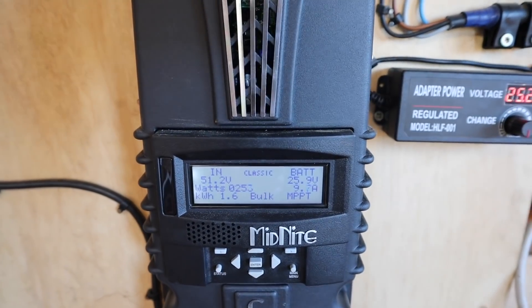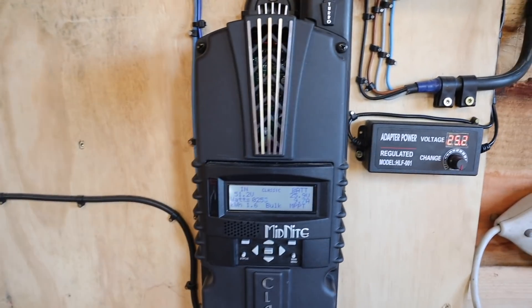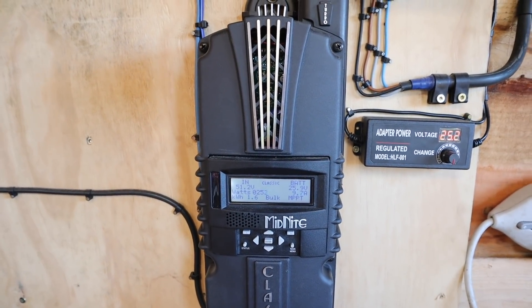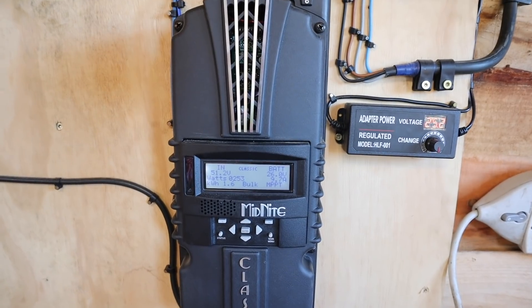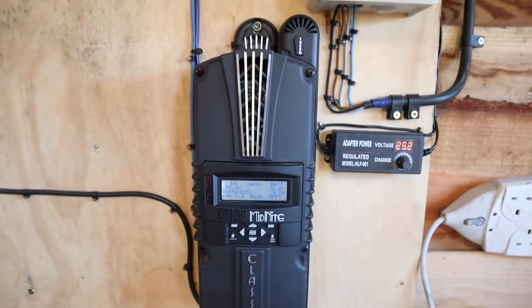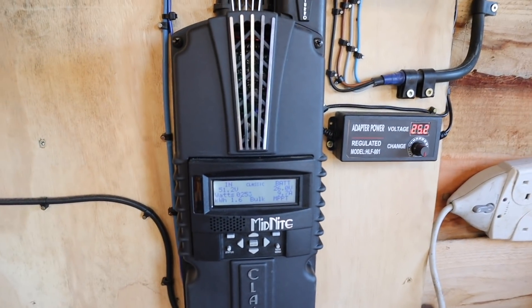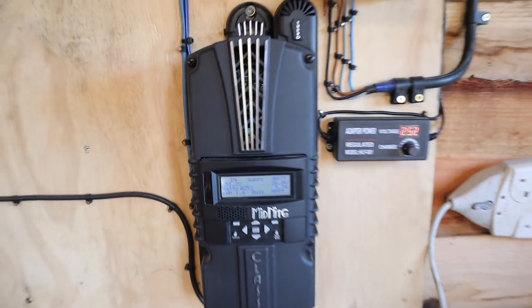It's all back up and running. Running it at 250 watts at the minute, probably got a little bit more than that. But at 250 the intake never gets blocked - if I run it at 300 or 320, I'll have to clean the intake off every couple of days. If I run it at 450, the intake needs cleaning a couple of times a day because it pulls the leaves right down onto it. Need a bigger intake to run it at full bore all the time. Battery's doing well, we've got a bit of solar coming in - it's quite nice out as you can see. We'll just run it at 250. Hope you enjoyed the video, thanks for watching.